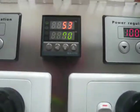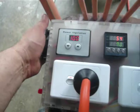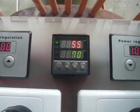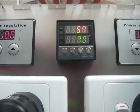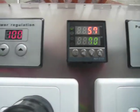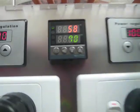The box is still nice and cool — heat sinks are cool, air coming out of the bottom is cool. But the temperature is going nuts. What I might do is let it run up to 70, let the PID sort its stuff out, and then I'll knock back the power regulators and let it slowly creep up to 78 and see what starts coming out of the spout.